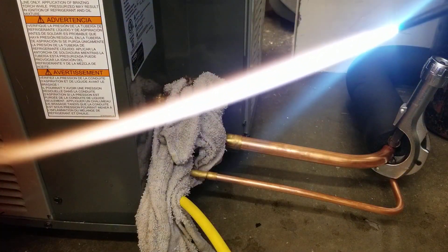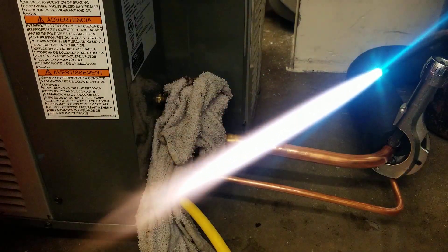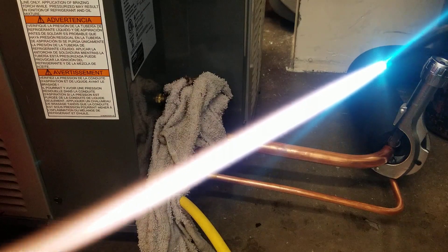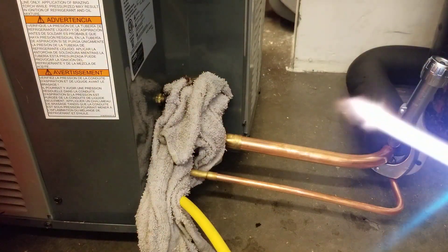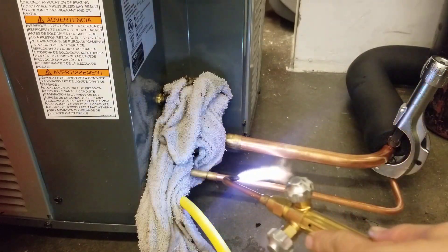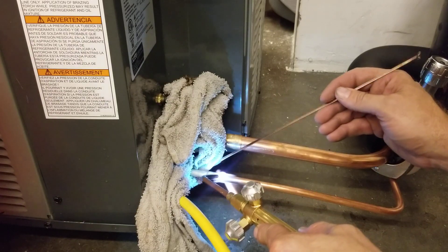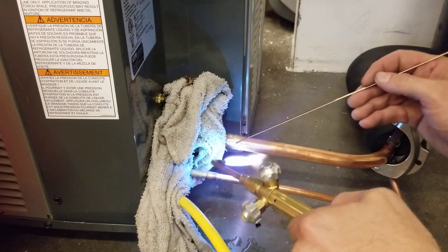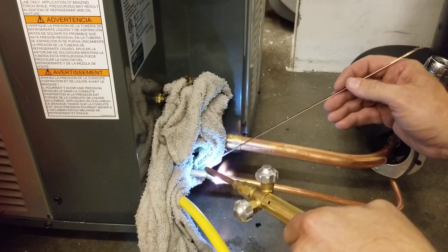So here I have my two cones. I'm going to add a little bit extra acetylene, and then add a little bit of oxygen. That's going to be a little louder than normal because that rag is going to be absorbing a lot of heat from my brazing. So what I want to do is heat the pipe first, just melt the brazing rod. Then I'm going to move the torch to the back of the coupling. Capillary action is going to put it into those joints until it's all the way around and in so deep.